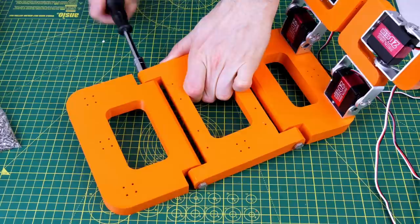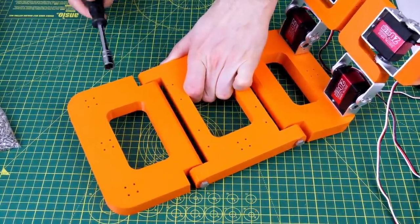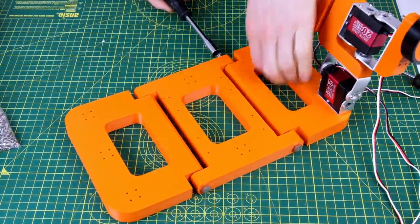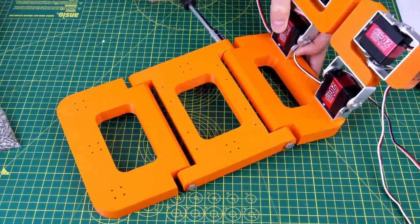The main body for the robot is also flexible — it has joints made of bolts which I've screwed into the plastic, making sure the outer holes are larger so those sections rotate freely. This will allow the body to flex as it lifts and bends to go over objects.